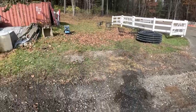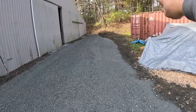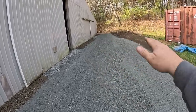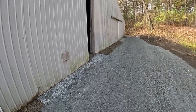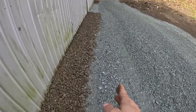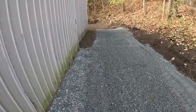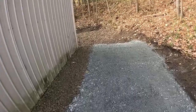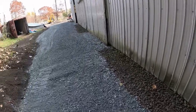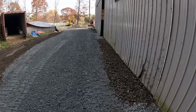Got the swale going here - we're stopping there because we've got that trench coming across, then the swale gets even better once everything's finished. The grade is nice - water coming off this hill is going to hit this trench. It's about an inch or two in this flat area, but anything rolls into this big trench. We kept it two foot off the building for the horses to walk. The stone is actually about 30 inches deep in the trench itself. We have the loop with stone for the wash bay - we'll put those mats back on.